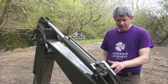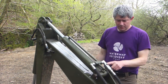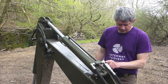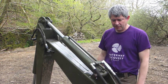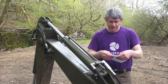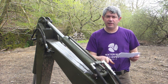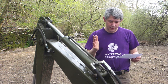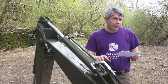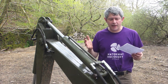You may have noticed that one side of the dipper - this part is the dipper, this part is the boom - the dipper valve has this funny kind of extension piece in. I've fitted this very recently and I'm staggered at the difference it's made. This is called a hydraulic fixed throttle check valve. These were under £10 each and they've absolutely transformed the machine. It used to be really quite a handful and quite jerky. I also had a problem with air getting into the rams and pulled my hair out trying to solve it.